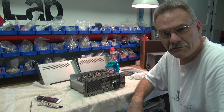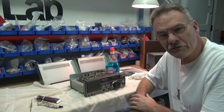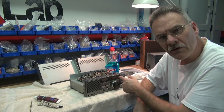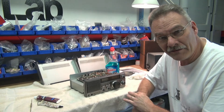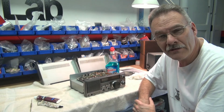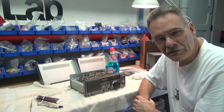The tuning issue should be fixed. And while you've got it torn down this far, you might as well give her a good cleanup. Wipe the panel down. I always pull off all the knobs, put them in some dishwashing liquid, let them soak, get all that finger grit off of them, and polish her up. It's actually a really nice-looking R600. Next, let's go put her on the antenna and see how she receives.